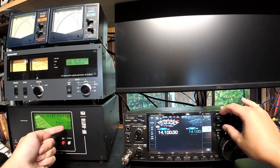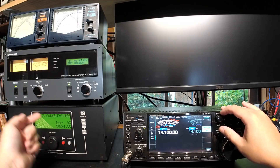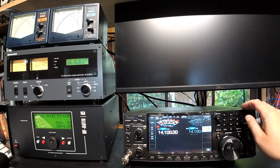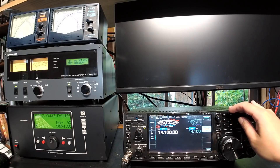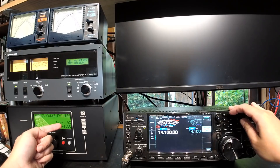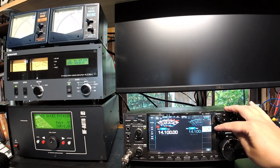This fault appeared before the firmware update, so it's not due to the firmware update. It does appear to be something like the drive transistors failing in the radio. I have no idea why — this radio has an amplifier and another small amplifier, and the radio itself has never put out more than about 30 watts PEP, so it hasn't been pushed hard. The finals are still capable of developing rated power; it's just that the drive gain needs to be inched higher and higher.